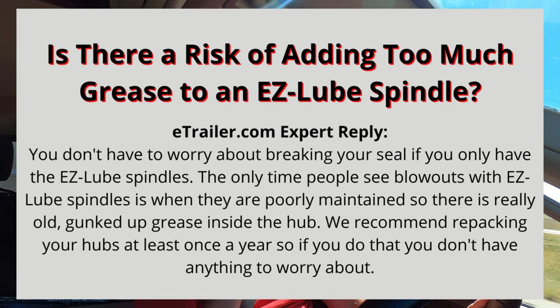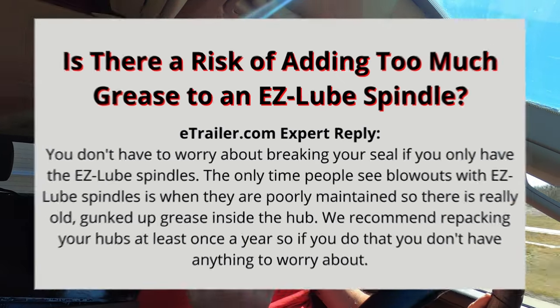But that particular person said you want to make sure that you're rotating it because you don't want to blow your seal. According to Dexter, and I'm going to find this and include it, as long as you've been maintaining your seals, you shouldn't have a problem with it blowing out. It's usually dry rotted seals that would blow, but they stand behind their EZ Lube system. So those are just a few things I wanted to add in there. And this was the first time that we were actually doing it to our rig. So if you do have any comments, please list them below on your experiences. But otherwise, we've been basing our information on what we're getting directly from the manufacturer of the Dexter EZ Lube system. Back to the video.